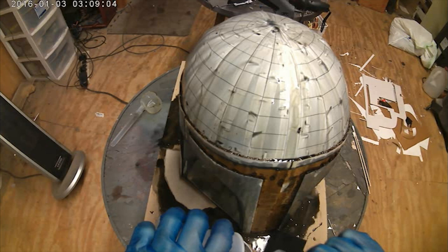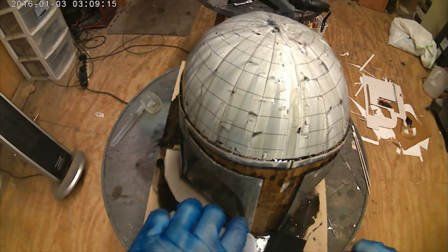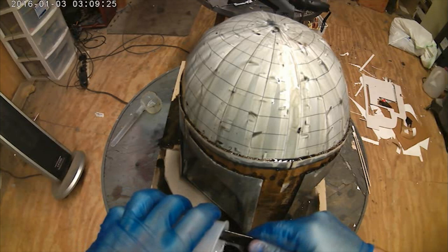Again, it's very important that you get all of the epoxy or the hardener, whichever you're pouring into the other. Make sure you get all of that material out and into the other part of the material, because if you don't, it will not harden correctly. It may not ever harden. It may take days to harden, and it may never harden correctly at all. And that's never a good thing.